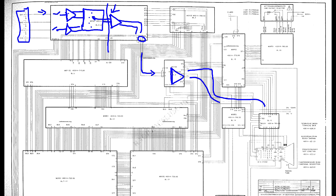MOY04 takes our differential pair, amplifies them up, and sends them to board MOZ01, whose job is basically to drive the plates. There's another board to drive the other pair of plates. Because our problem is across all channels, we know it must be in the common parts of the circuitry.